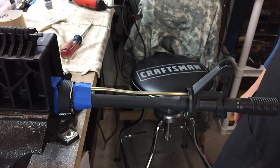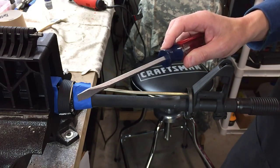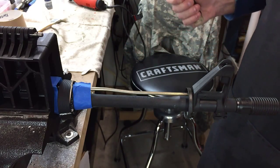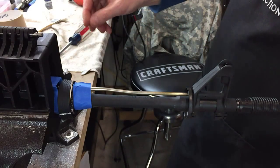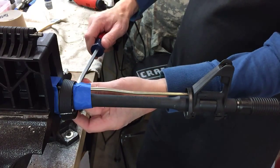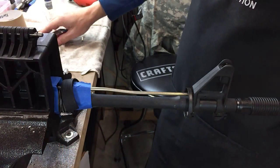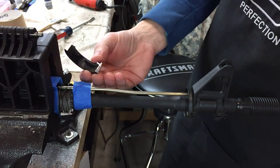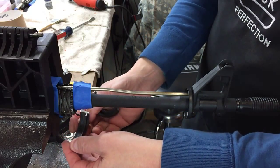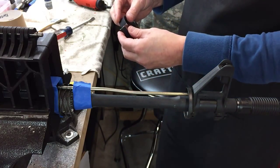You can see right there, I actually got a couple little jumps from the Dremel where it nicked up one of the lugs on the barrel nut. That's not the end of the world. The back half you can cut through fairly easily because when you cut through it, you can see the metal springs. But on this front part, it's really hard to see because the front part of this delta ring is thicker. You don't want to just cut and cut and cut right into your barrel nut. I found if I could wedge something in there to hold this back, I could see a little bit better. I left a little bit of material on the front, then used a flat blade screwdriver to break this delta ring apart. That side broke away pretty easy — so the metal delta ring is removed.